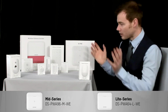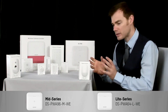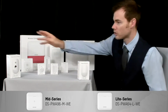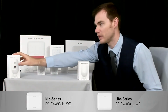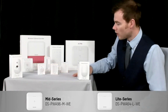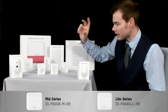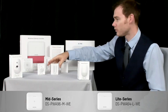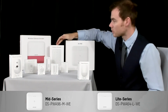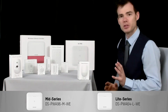So it's a fully wireless solution, and comes in an array of peripherals. Again, you bespoke exactly which ones you want. We do things like the wireless intruder detector. We also do the PIR detector with the built-in camera and also an IR illuminator in there, so you can get nighttime images, as well as the wireless key fobs, the magnetic door detectors. We also do it in a slimline version. Wireless internal sounder. We've got the wireless keypad as well, and the external sounder as well. So there's an array of peripherals that you can put in place.